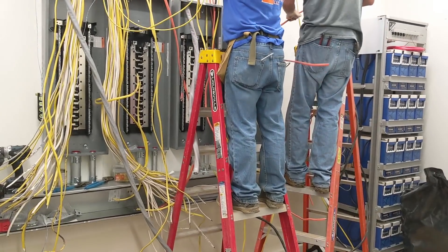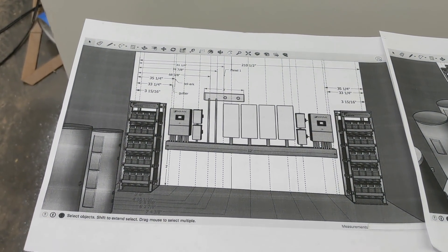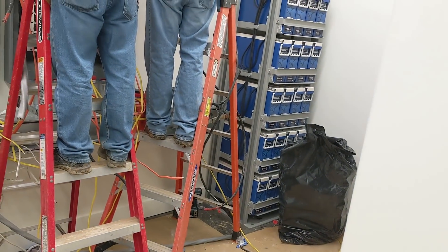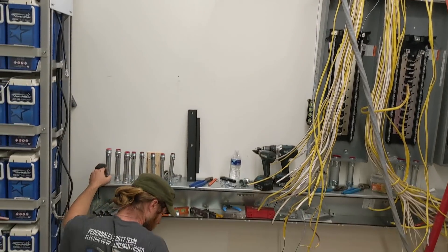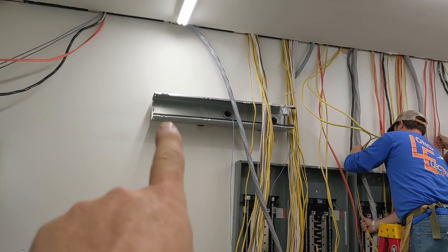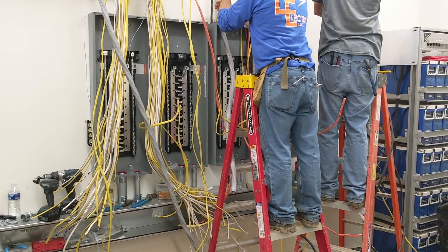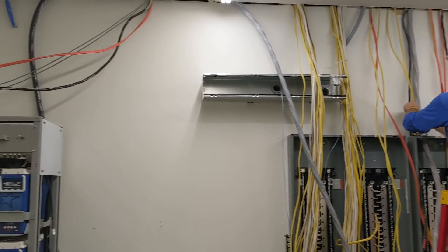The goal is to match this — it's our first start with SketchUp to design the system, so how's it looking? The goal was to save a lot of time and put everything where it needs to go rather than too many guys in a mech room scratching our heads trying to figure out where things go. Solar is going to be pulled through there and drop down, and then we've got a generator and generator control panel. I'm going to mount that on the battery rack, and we'll get our transfer switches in next. This is the beginning of day two of the awesome mech room — this is part two, phase two.